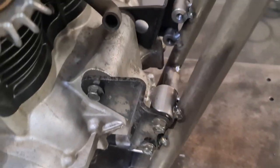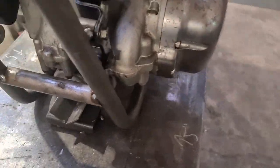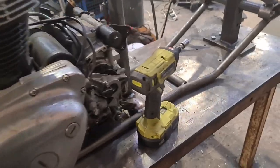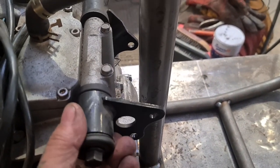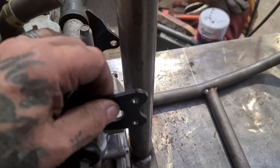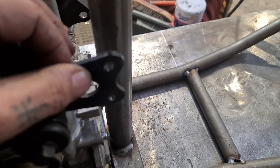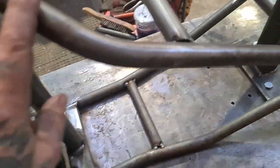Those are tacked in. I did have a slight miscalculation on this side - I needed to skinny these down a little bit. They're 21.4mm rather than 25.5mm because that's how it fits the existing plate, which I intended to use - absolutely no problem. Now we're onto the rear mounts. I need to use the standard plates because they've got the rubber mounts in - I'm just going to make standoffs like I just have for the front, but shaped a little around the centre post. I'll machine that same bar down to 25.5mm so it matches the tube.